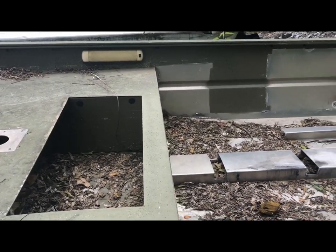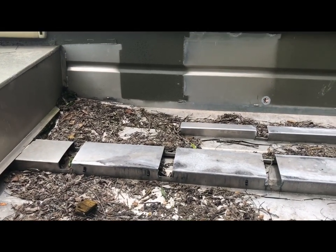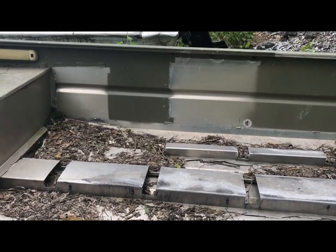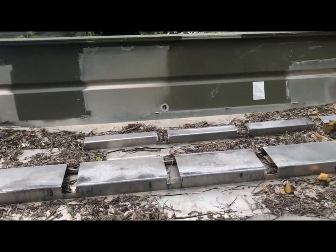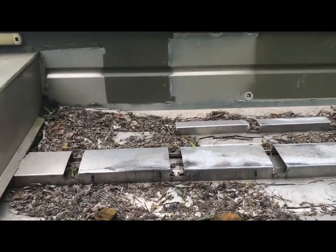What they don't tell you about blown-in foam is it gains water weight — the foam will actually gain quite a bit of weight, probably more than the boat itself weighs. If you weld around it, it catches on fire. And it turns into jelly if it comes in contact with gasoline.